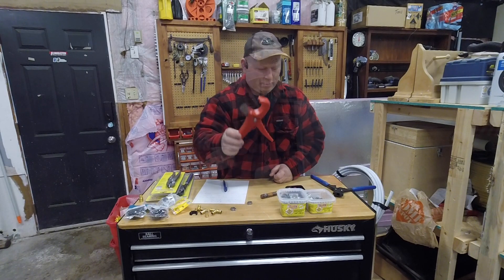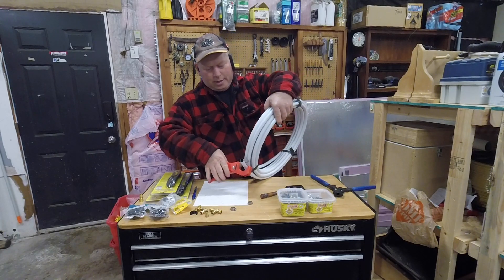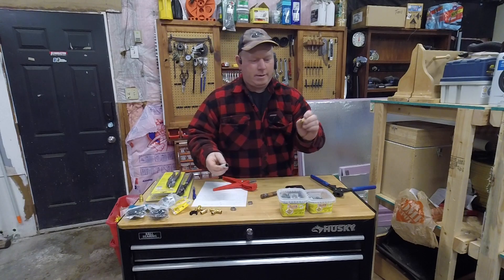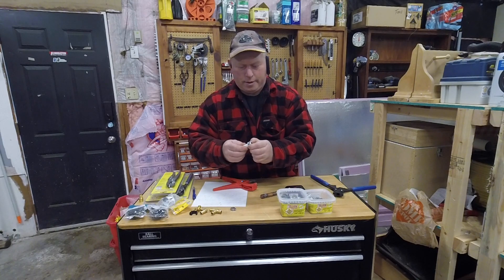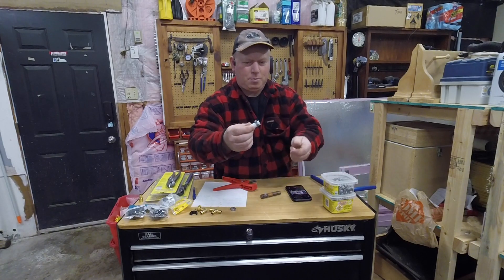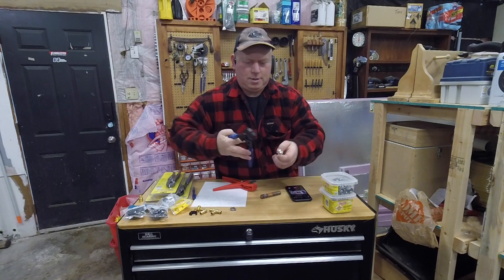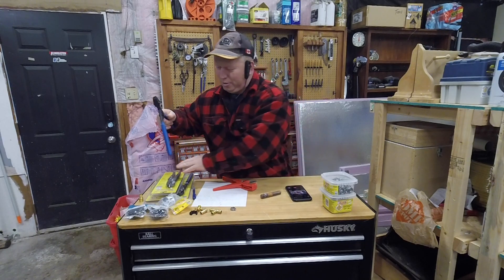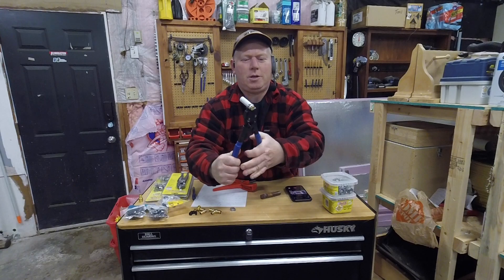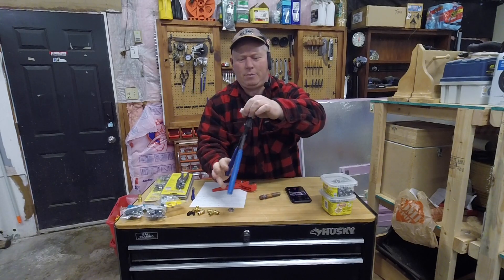Here's some of the tubing. This just shows you how quick and easy it is. I'm going to cut a piece of tubing off — there's a piece of tubing. Now I'm going to crimp this plug on here. You put the pinch clamp over top of the tube, put it over top of the fitting, and move it down a little bit. Then you take your PEX crimp tool, put it inside, hold it like that, and just push. It's quite a lot of pressure actually. Once it's all the way, you release it — and there you go.